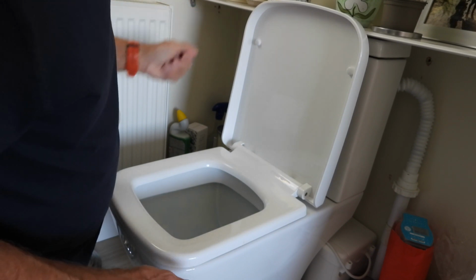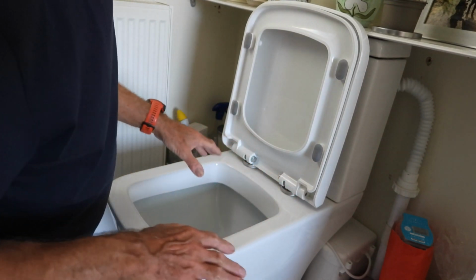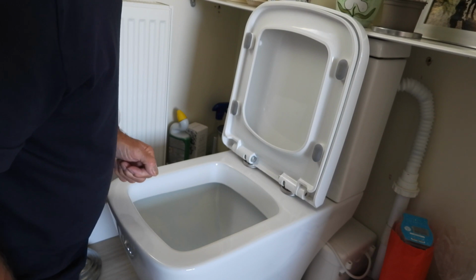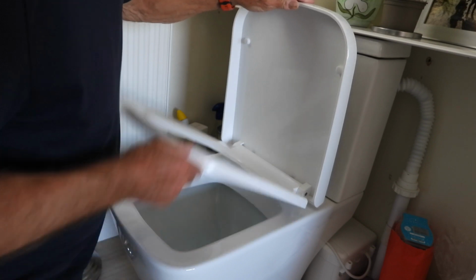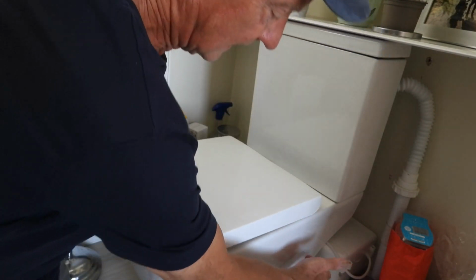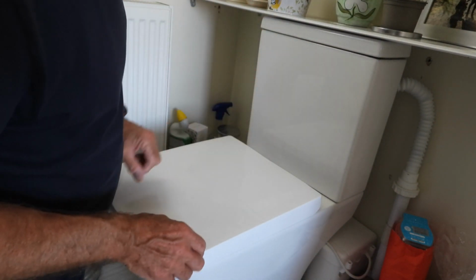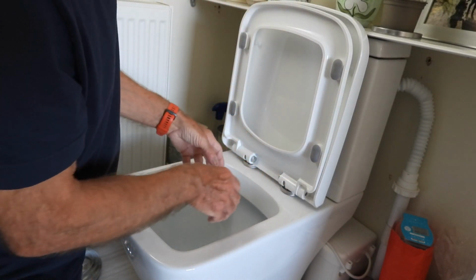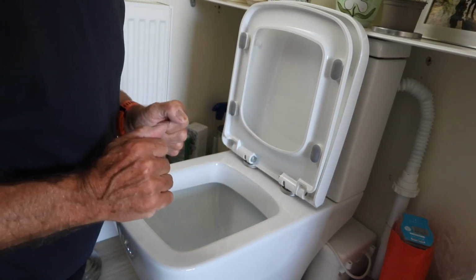So you've got your seat there, and you want to clean the pan properly along the top, but it's right in the way, isn't it? You'd like to get that out of the way, and you could do a proper cleaning job and make sure that it's all fine. Well, I know when you first really think, well, how is that bolted in there? And obviously, because it's bolted through there and there, but there's nothing under there. You can't get under there to anything. You can't reach anything. So how's it done? Well, they've actually got kind of like expanding bolts that go through there, and when you tighten them up, they expand the rubber and it locks the seat there.